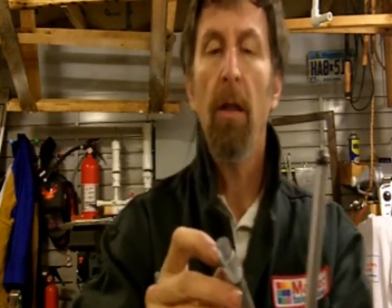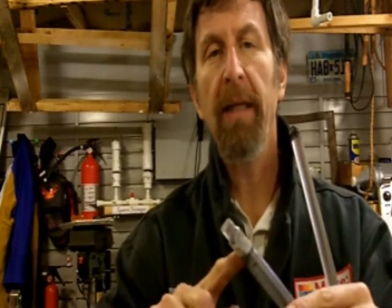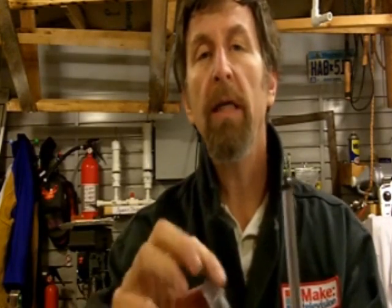After it's been assembled, you may need to do some troubleshooting in order to get your fire piston to work correctly. I'm going to show you the two places that people most commonly have problems. The first place is the plug seal going into the tube — it must be completely airtight. When you epoxy it into place, make sure the epoxy is spread completely over the interior, and put a little bit of extra epoxy on the edges to make sure no air can escape. If it does escape, you're going to have to re-epoxy the joint. The other place where people often have trouble is making the char cloth. It seems simple, but it can be difficult. If you see a flash in the bottom of the cylinder yet the char cloth does not ignite, the problem is not with the fire piston — it's with the char cloth you made. Try another batch and keep trying until you get it right.